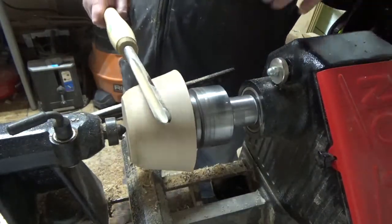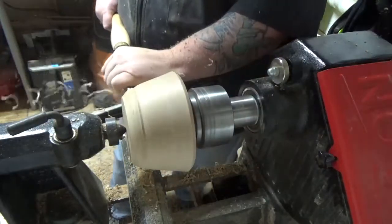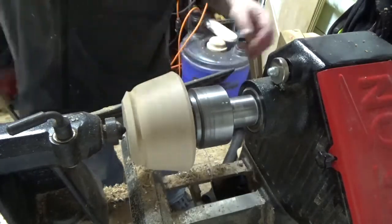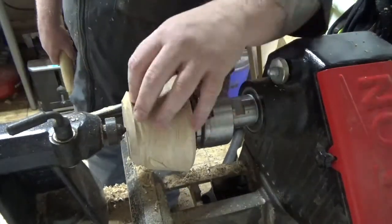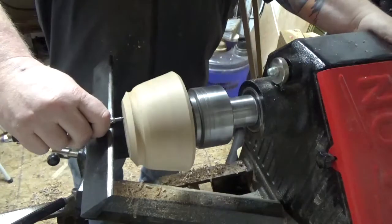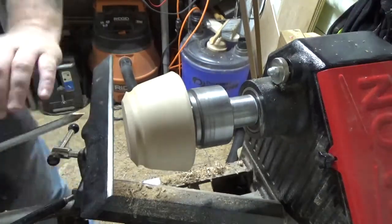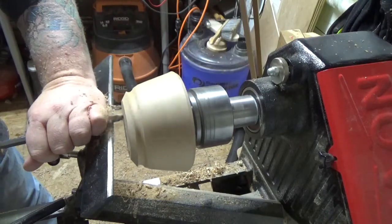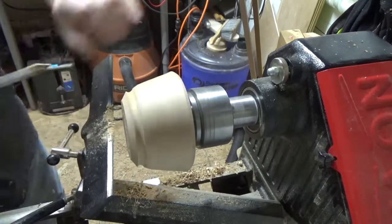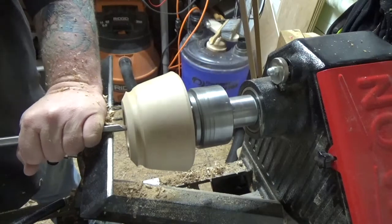With the final pass of the outside, I like the shape but I kind of felt like I wanted to put something on the bottom — almost reminds me of like a teapot or teacup, or a flower pot maybe. Just something basic. It already had a neat pattern with the ambrosia. Now I'm just marking the bottom to put a little recess so my jaws can go in there. Because my jaws have an angle to them, I like taking my parting tool and setting that in there so I know the depth and the angles.